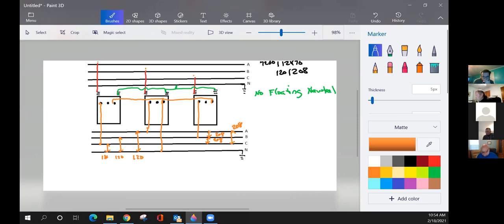And I guess this might freak you out a little bit. There are different voltages in Y and Delta as well. But in Y, instead of a 120/208, you're going to look at a 277/480 bank. It's the same thing. You get 277 volts out of each transformer. And then phase to phase, how do you get 480 out of 277, guys? And he's still on Y here. So he's saying he's got 277 phase to ground, A, B, and C. How is he getting 480 phase to phase? It's magic.